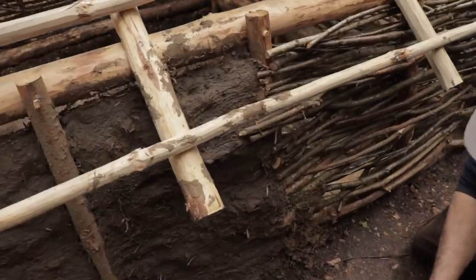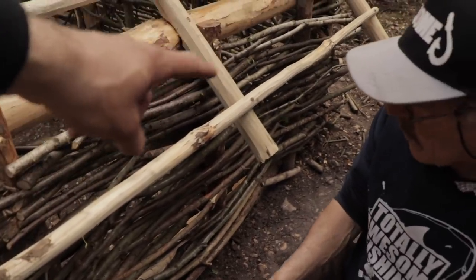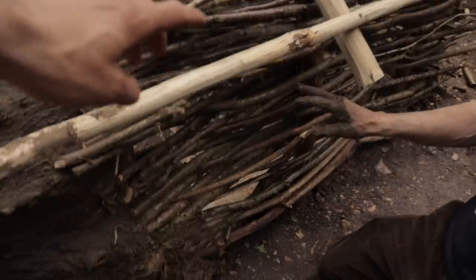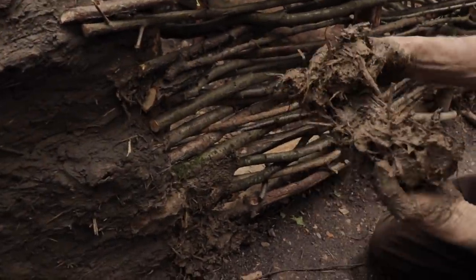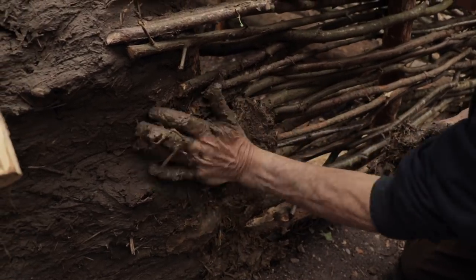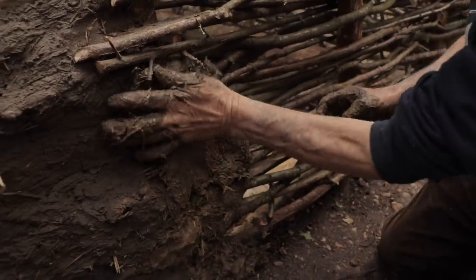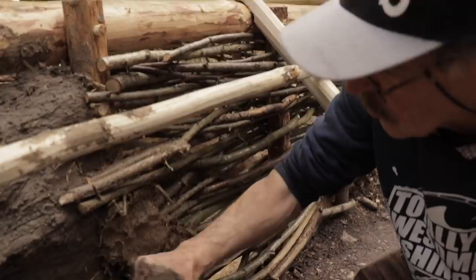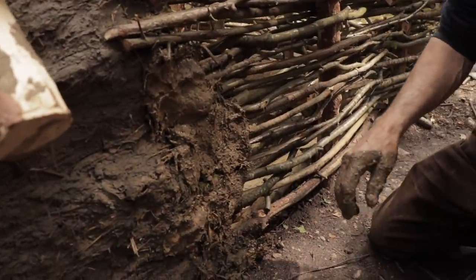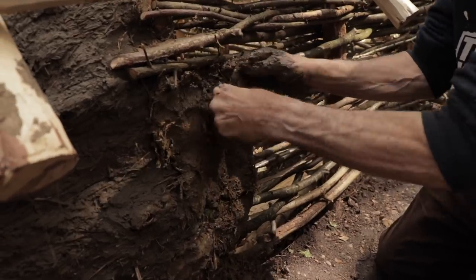So, Dad, I was saying to the subscribers that this is the single stick wattle here. Yes. And this is the proper green wattling that we did, and we compacted it all down. We probably could push it down a bit further, but this should be interesting. I reckon it'll be easier. It should bind, and the sticks are much more rigid because they're not dead. Do you find they're not flexing as much? Well, the holes are smaller as well, aren't they? So it's taking the clay better. It's going to stick. Yeah, pushed it right in.